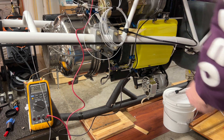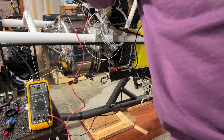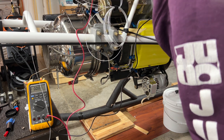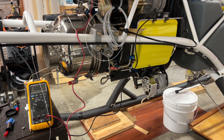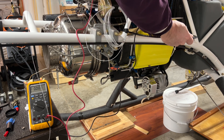Okay, for a full 8 seconds the wire gets quite warm — hot, I would call it hot. The number 6 wire that runs from the starter motor to the starter solenoid is okay, it's a little warm but that's about it. The connection at the primary power system is fine. Again, the number 8 wire does get fairly warm.